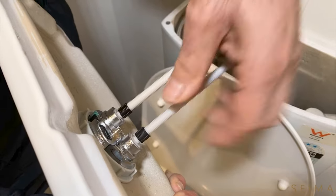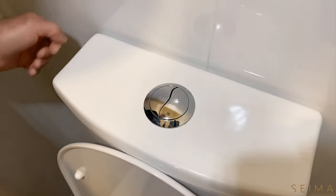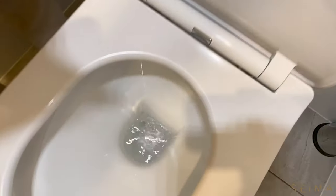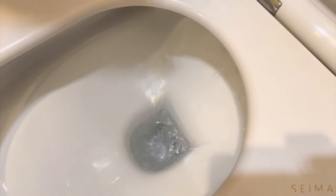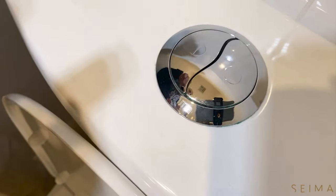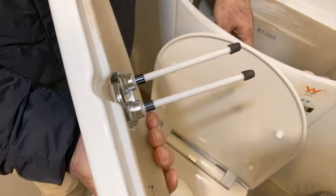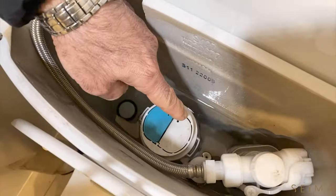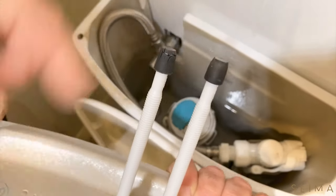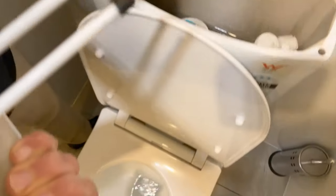I'm going to make this one a little bit longer and put that back on the toilet. And you can see — or hear — that we're now actually causing the water to overflow and you'll hear the toilet system turn on every so often. The reason that's been caused is that the pin is actually pressing on the flush mechanism. Because it's too long — and you can see how that's just a few millimetres — it's depressing on there and causing the water to exit.